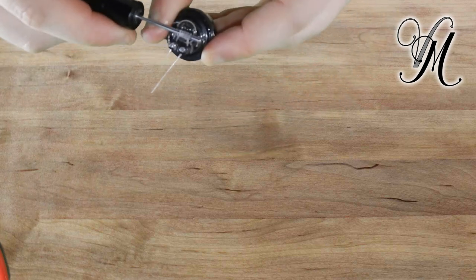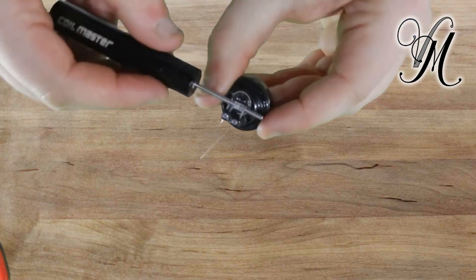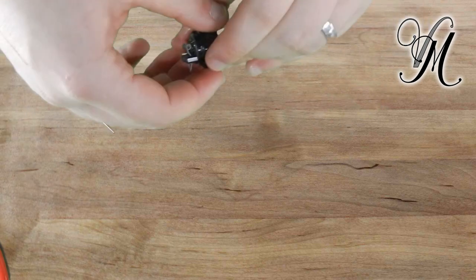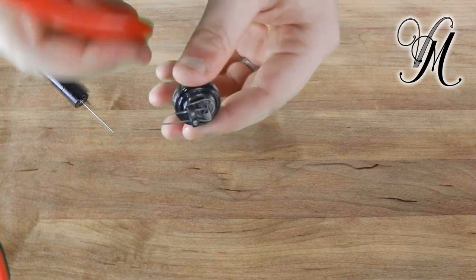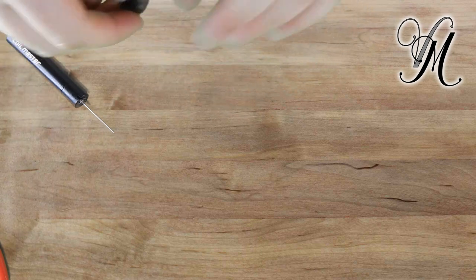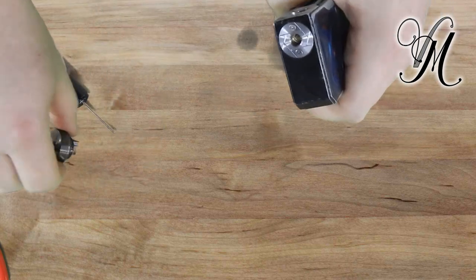Use your jig to realign. The reason you use your jig is because it's the same size as the coil diameter, so you won't get it skewing as much or being thicker in the middle. Now we've clamped it, we can cut it. Get a quick cut. Move it.